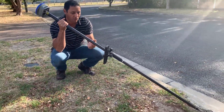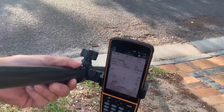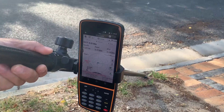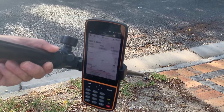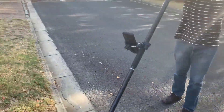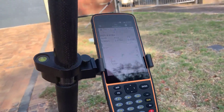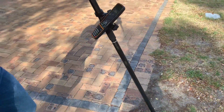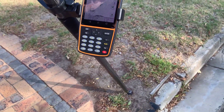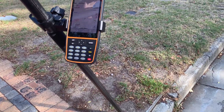Now I'm going to move the pole off the point. Look at the accuracy there — I'm putting it back in and it's still two centimeter accuracy. Off, back in. Looking at the accuracy, it's still one to two centimeters. I'm taking it into the next quadrant. I'm still on the point — pull it off, it's quiet, put it back in, off. Nice refresh rate. I would say this IMU is excellent.